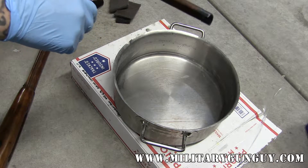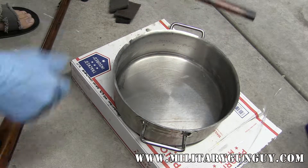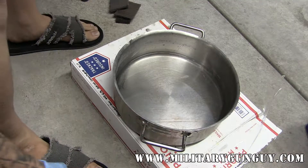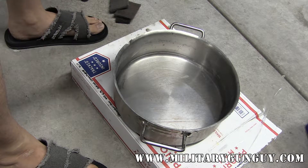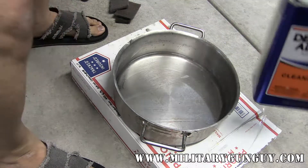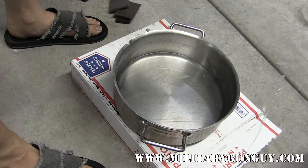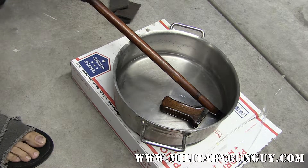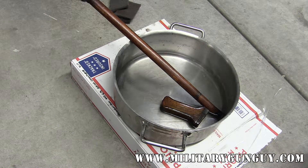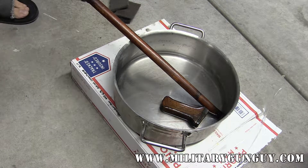I have found that the typical paint strippers you can find at Home Depot or Lowe's don't seem to work very well — they end up not being strong enough. One of the simplest things you can use, and you can get fairly cheap, is denatured alcohol. You can buy it for about 20 bucks a gallon with tax, get it at any hardware store, and simply let your parts soak. It starts to remove the layers of shellac and gives you a nice, very basic wood finish.